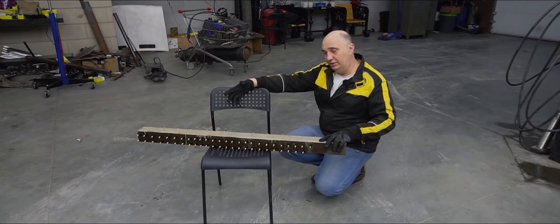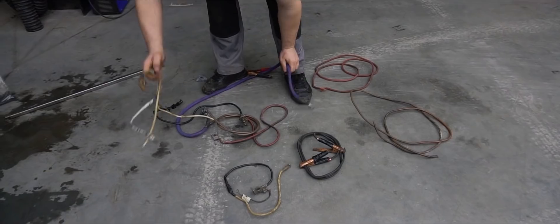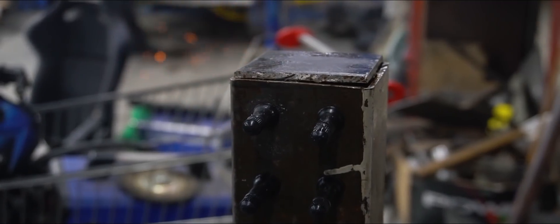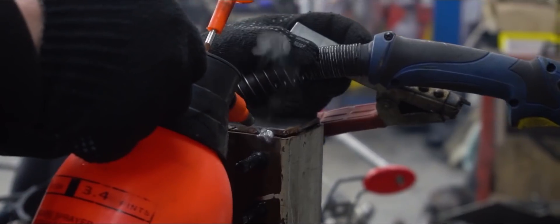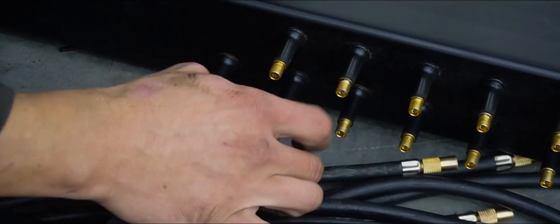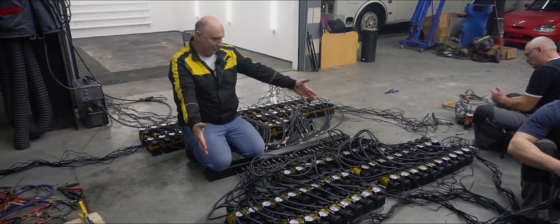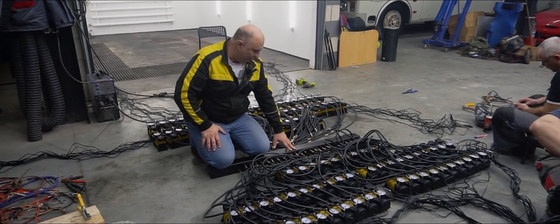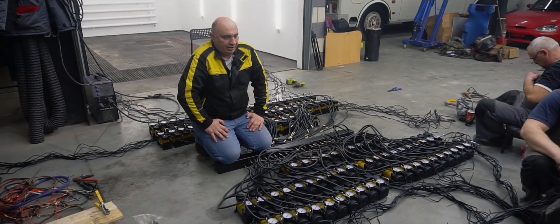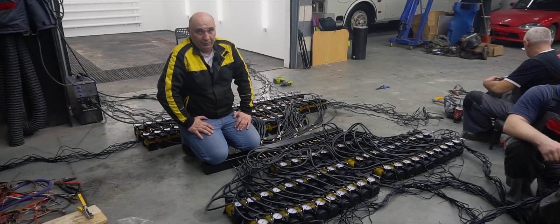On one end you just attach the inflators and that's it. The wiring is going to be a bit more challenging though. Let's carry on with assembly. We now have 50 inflators already routed into the rail, which is good. But there's a slight issue — we just measured how much current the inflators need, and it fluctuates between 8 and about 12.5 amps. Multiply that by 100 units, each taking 12 amps — that's a total of 1,200 amps. Where can we even find that much?